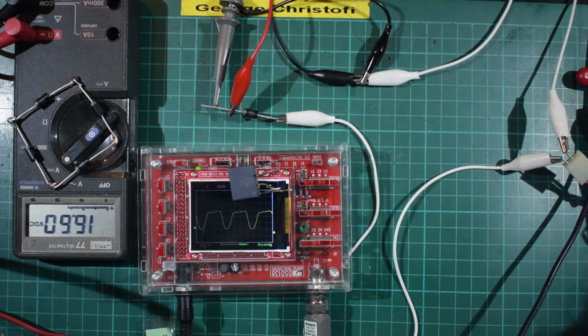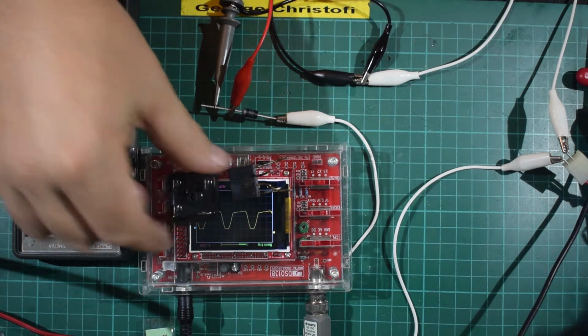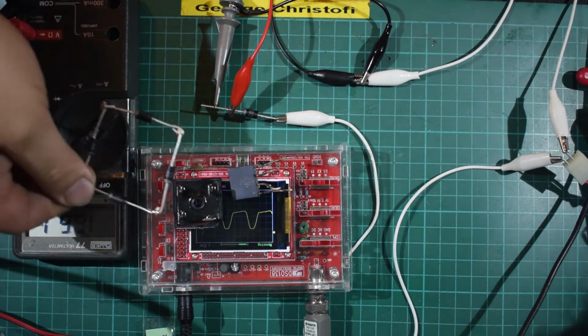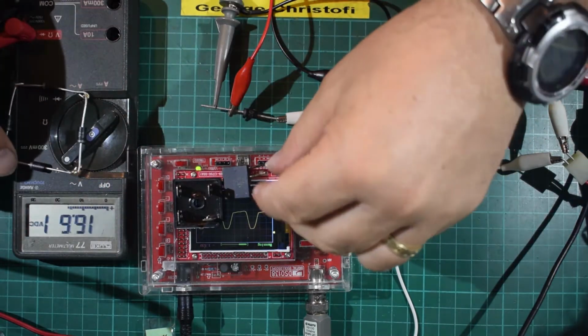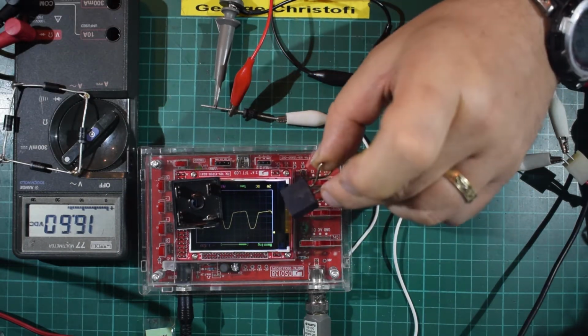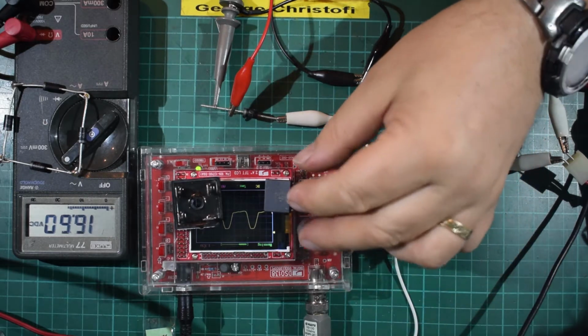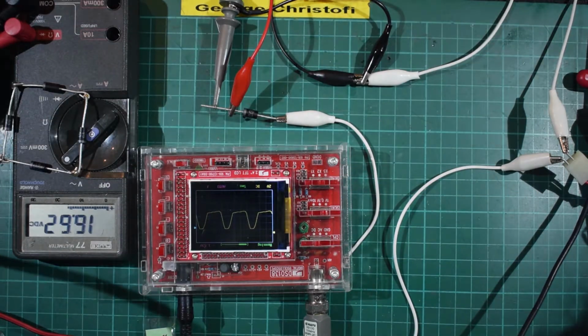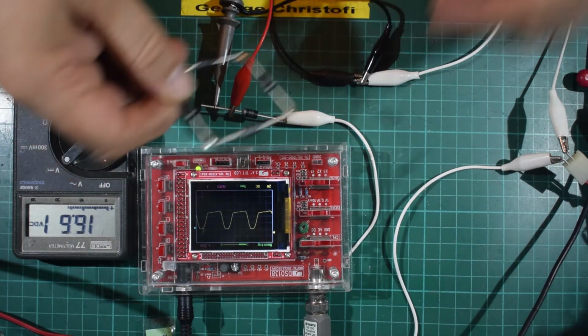Let's have a look. That one's plus. That's the AC. That's the AC. And underneath this sort of gooey gunk, all you have is 4 diodes. In this package here, all you have is 4 diodes. It's just that they're laid out in a different format. So if I take those away, and let's stick with the 4 diode format,